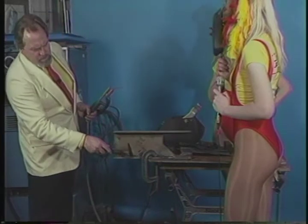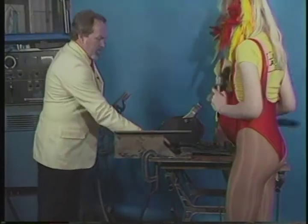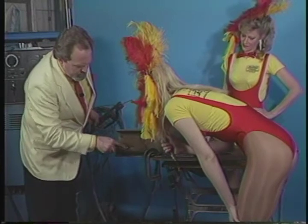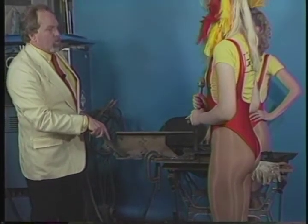And again, you should really do safety glasses with this. All right, now what do you see? Now you can see down to the weld. To the weld bead, right? All right, I'm going to wire brush it off a little bit. And again, that's one of the problems with the stick welding, is that you've always got that mess to clean up and all that, okay?